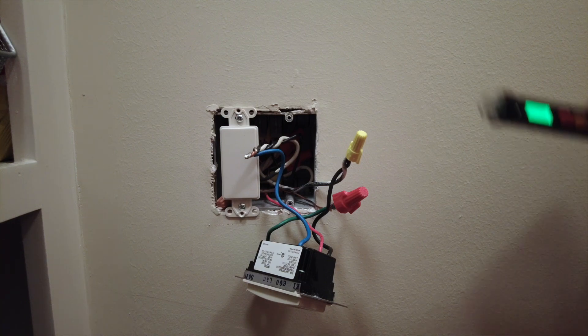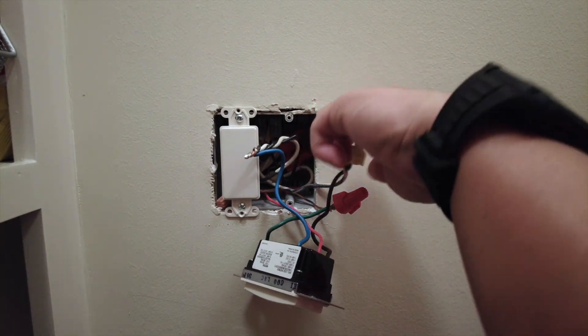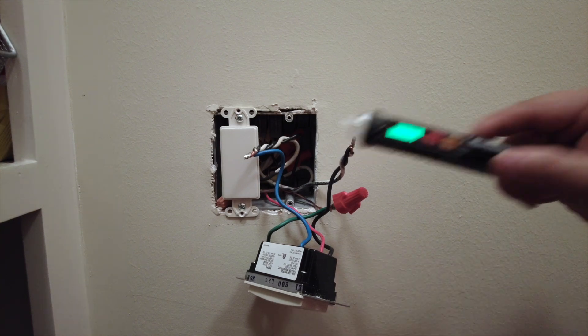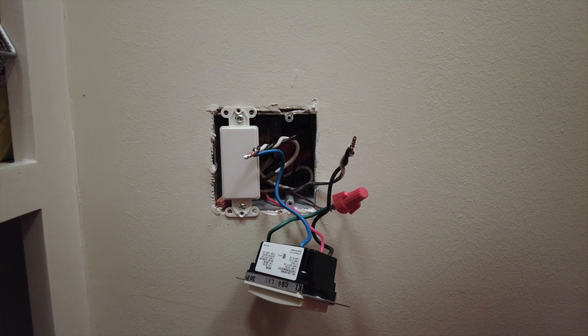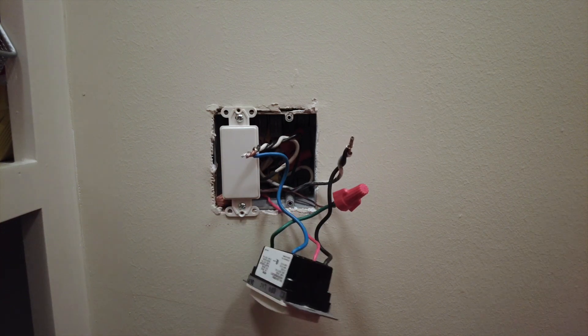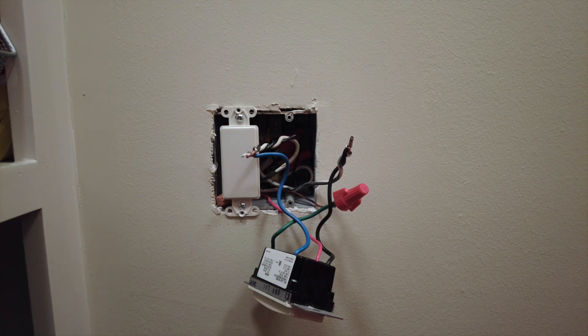The voltage tester avoids harm from shocks, and they're only about $10 to $15 — very useful. I even removed the cap to get closer to the actual bare wire without touching it with my hand. Once I confirm they're not live or hot, I can do another test using my fingertips to make sure I don't feel anything. So with the bare wires exposed, the right side is the hot with the black wires, and I have blue, black, and white all together — that's the other side of the hot.